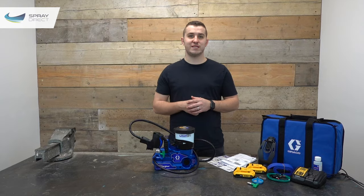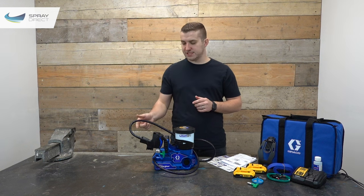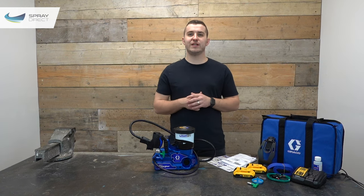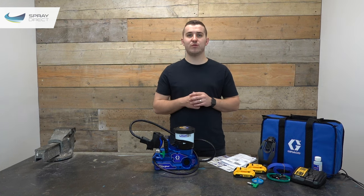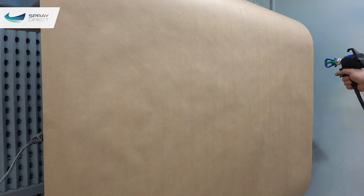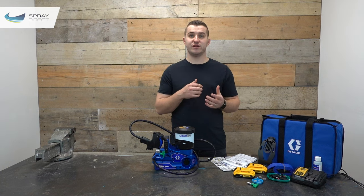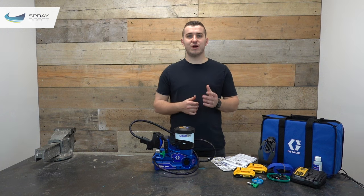The gun feels very much like the popular Graco Contractor PC Compact in terms of physical size, but it's also very light and maneuverable. It's fed with a six-foot airless hose protected with a braided sleeve that also houses some electrical cables. Unlike conventional airless guns where you pull a trigger to mechanically pull a needle off the seat, with the Quick Shot gun when you pull the trigger you're pressing an electrical button which opens a valve to release the material. Releasing the trigger shuts off the flow so fast it virtually eliminates those annoying spits altogether, and because the trigger is just a button it requires much less force, hugely reducing repetitive strain in your fingers and forearm.